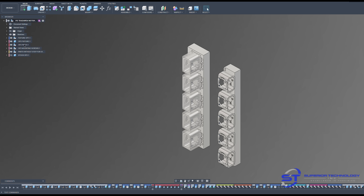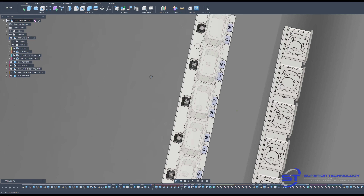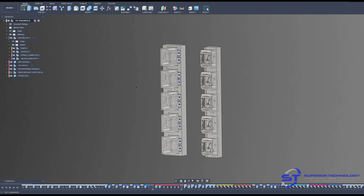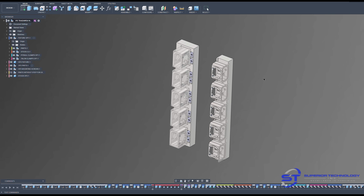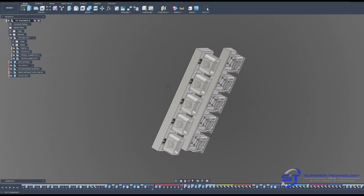When I first got this job — it's an 1,100-piece quantity — I didn't want to do just one piece at a time in a vise. I figured I'd do five because that gives me enough time to amortize the tool changes out and decrease the effective cycle time of each part. It's not a very complicated work holding setup: a pocket with two talons and a pit bull on each one for OP1, and three screws on OP2.